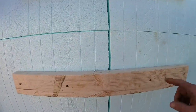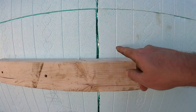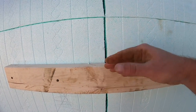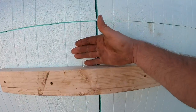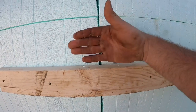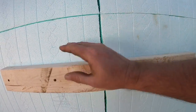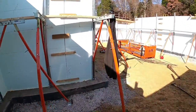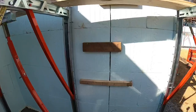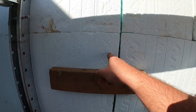One other thing I'll point out real quick is this is what we call a three line common. One, two, three, one, two, three. So the strapping on this common needs to catch at least four studs, because you have the same issue you have next to that window where it wants to pop out, and you got to keep that block nice and flush across that common. That is the exact opposite scenario on this particular common here, is you have a stud here and a stud here.